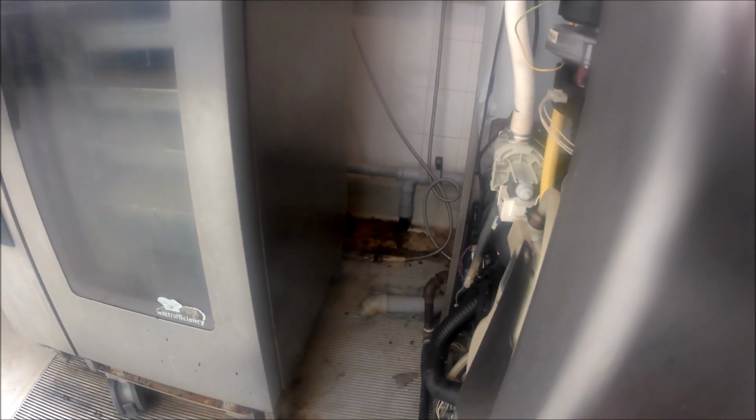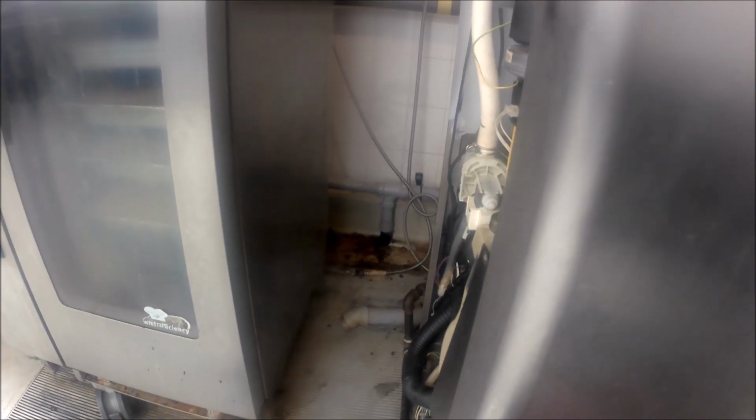So we're going to do a clean jet function test here. I was getting stopped at 2 minutes earlier. Okay, so that's when the pump is actually running during this function test. And we'll just hit fast forward here. And if we complete it, we get a little check mark here, which is good. If not, you'd get a yellow exclamation mark. So we've cleared that error code now.